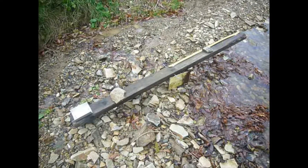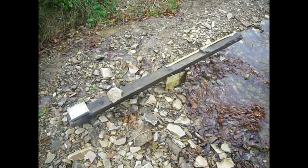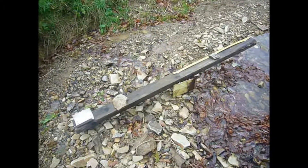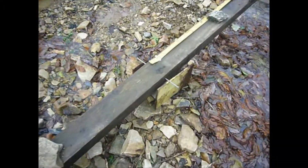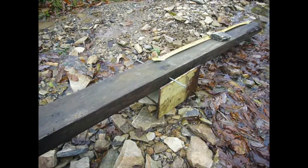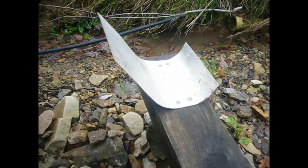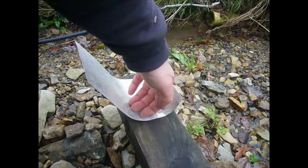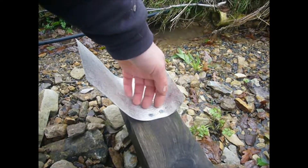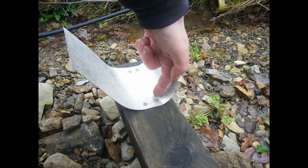This was another experiment I came up with - to roughly give us the force of the jets of water coming out of the different size nozzles. What we've got is just a piece of wood balancing onto a couple of nails on the top of a piece of RSJ offcut. At this end we have a piece of aluminium curved up in a similar fashion to a turgo or Pelton bucket. The nozzle would be pointing in this sort of angle and then ramping around the curve.